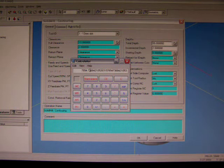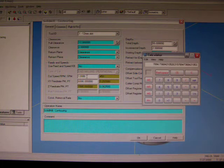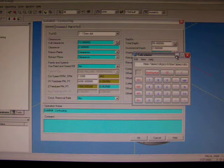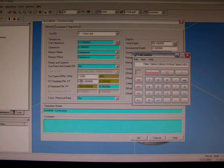The cutter recommendations are just that, they're a recommendation. We're using a pure billet aluminium, which is obviously impurity free and is not very abrasive on cutters, so that's why we've bumped our speed rates, and this is where experience comes in. I know that the cutters that we use work best at 12,000 RPM for the 12mm solid carbide cutters, and the feed rates or chip loading, which is your X and Y feed rate, is usually about 0.1 to 0.2 per tooth, depending on your cut application.